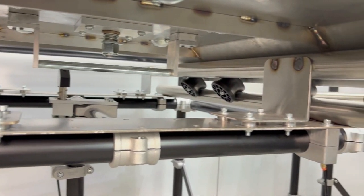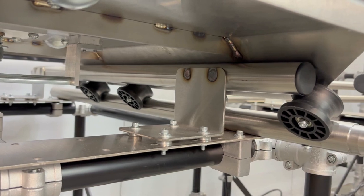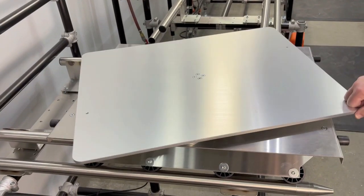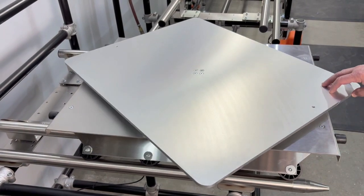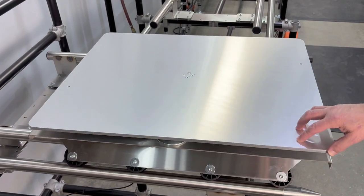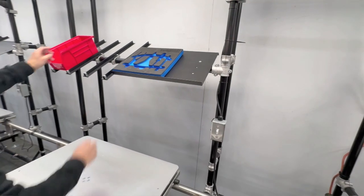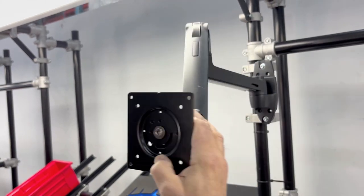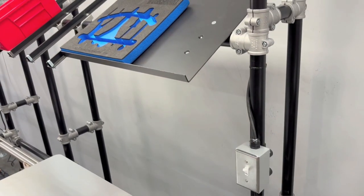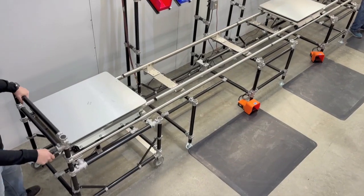The carts had eight wheels, a reinforced stainless steel body, and larger ball transfers supporting a thick cast plate that rotated for enhanced assembly. With a 250-pound payload, the cart had a breakout force of less than 10 pounds. Each of the six positions would be equipped with parts presentation, a monitor arm, lights, a shelf, and a tool trolley.